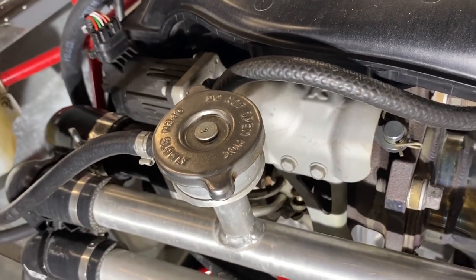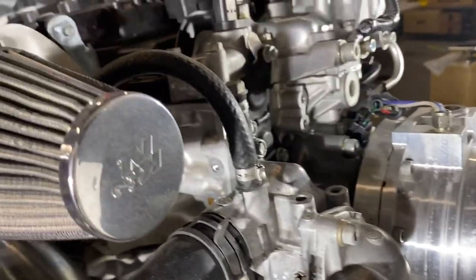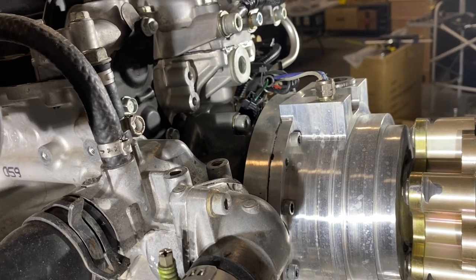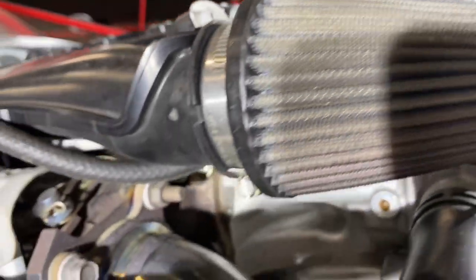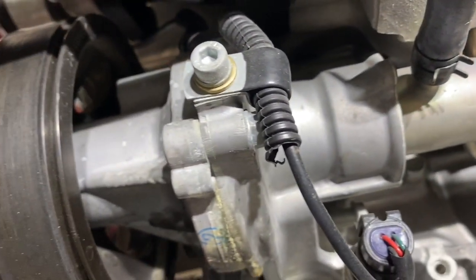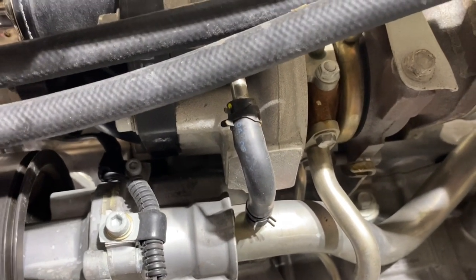Your thermostat cap — a five-pound cap because NPG coolant runs at low pressure — is likely tapped and threaded in at this location, which is slightly different from what's shown here on this older setup. Some other cooling lines associated with this engine: there's one that cools the turbocharger — very important — and then there's a return from the turbocharger that goes right back into the pipe leading to the pump, completing the circuit to cool the turbocharger.